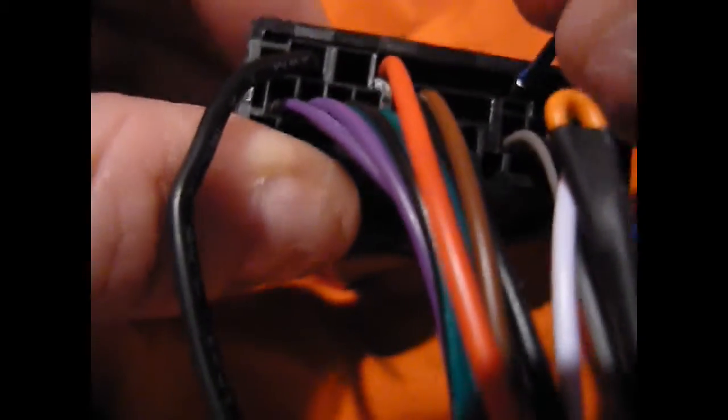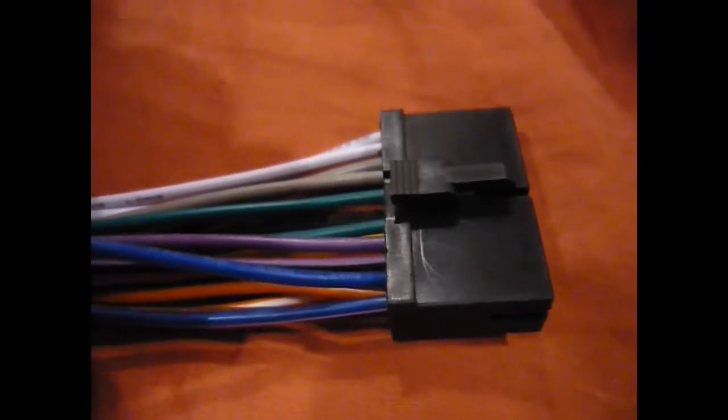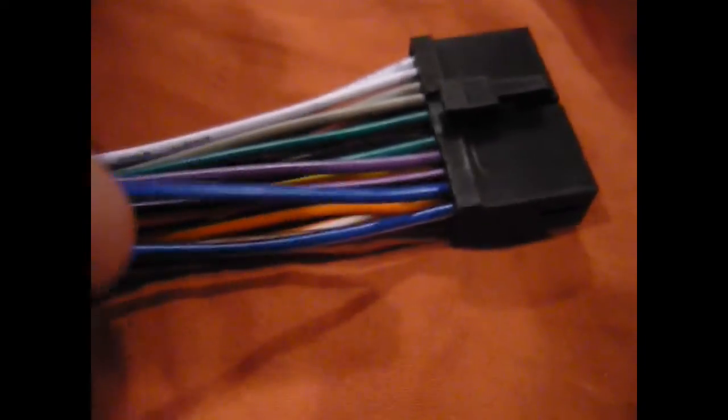It's right next to the yellow wire, the small slot. You're going to push your pin into the hole and it should lock in place. And if we look at this side, there should now be two pins in the bottom smaller half here. This is very hard to film, but there are in fact two little pins in that hole — one's on the left side, one's on the right side; one's on pin 11, one's on pin 4.